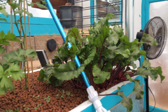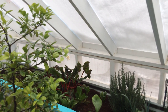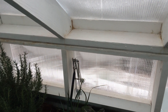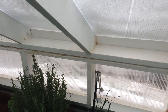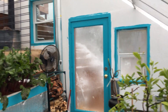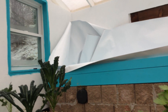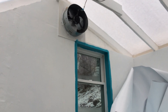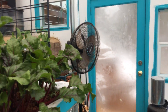All in all, the system seems to be working relatively well. I have had some ventilation problems, which required me to install automatic vents in the front. When it gets too warm in here, these vents will open up to allow fresh air into the house. I also have four windows for additional ventilation, as well as a peak fan that draws the air out if it gets too hot, and it's run on a solar panel sitting outside.